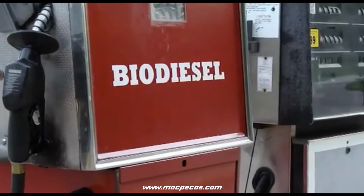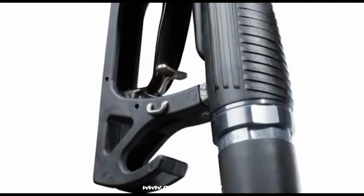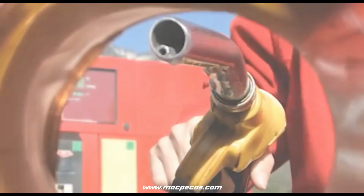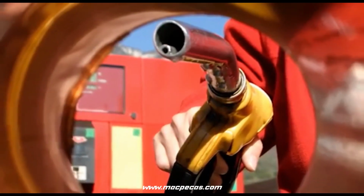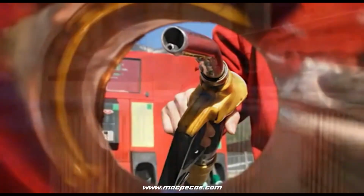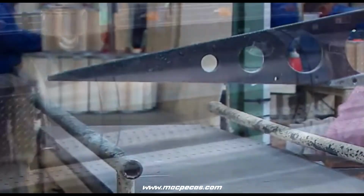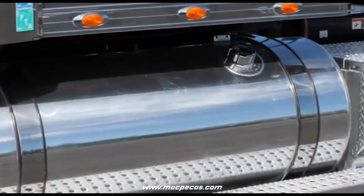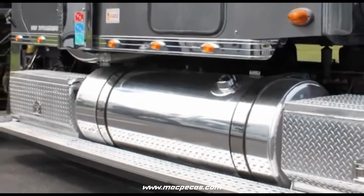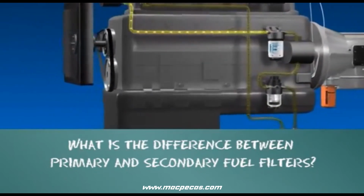If using biodiesel, make certain your fuel supplier meets current fuel standards. Ensure that your engine is compatible with the concentration or percentage biodiesel you wish to use. Note that if you intend to change from ordinary diesel fuel to biodiesel, you need to be aware of biodiesel's possible effects. The engine deposits that are released when you switch to biodiesel can clog the filters. If you plan to switch fuels, cleaning your system before making the switch to biodiesel will help prevent or minimize additional maintenance expense.